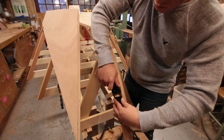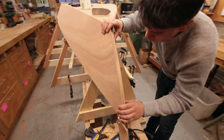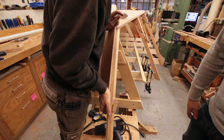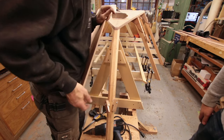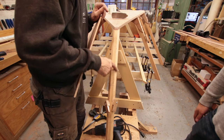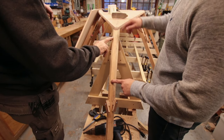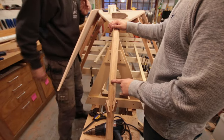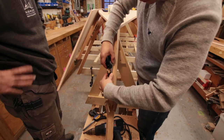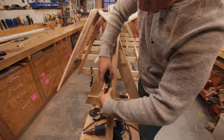Don't go too far without just checking your fit. It's looking good. There's a ton of daylight over here - we've got a big gap, but we aren't to our line yet. I'm confident to say go ahead and keep taking it down to that line at this point. Right down to the line - and I think you can keep it flush the whole way down given how much it's standing off right now. You're safe to do that. Go ahead, you're doing great.